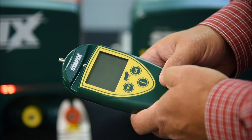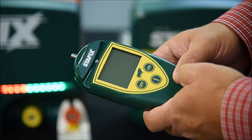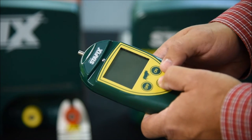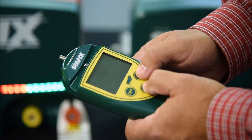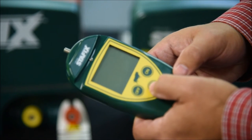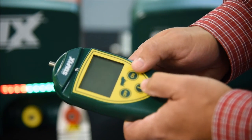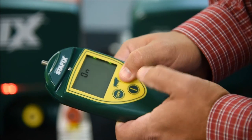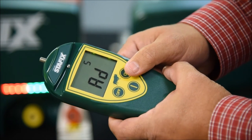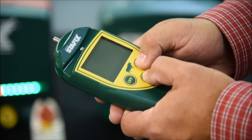To get them into standby mode, we've determined the address for each one of these energizers. On our remote handset, you push the all-off button — this is the power button for the remote — and this is the 'on' button which turns the energizers on. We'll push those simultaneously; that allows us to toggle through the settings. Notice that one's set for address 5.